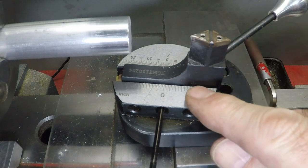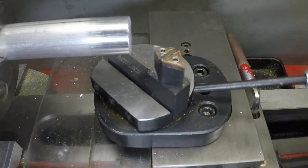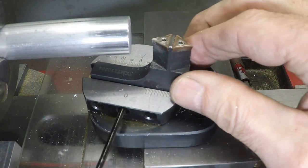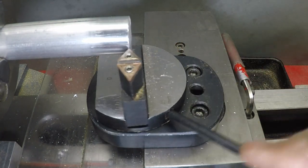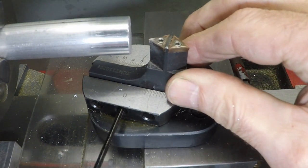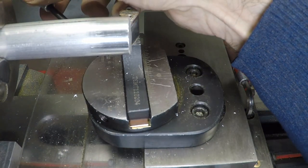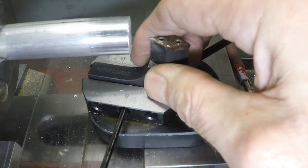I don't think that was a design flaw. So now I'm setting it up for an approximate guess at the radius, and then I'm going to check near and far and keep adjusting until I find that it clears on both sides just equally. So that's close. I'm going to ease it in a bit more, and eventually I'm going to put proper markings on my calibration for that, where the little arrow intersects with their imperial measurements there on the actual jig.